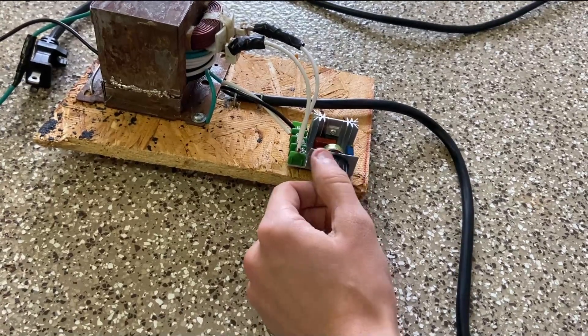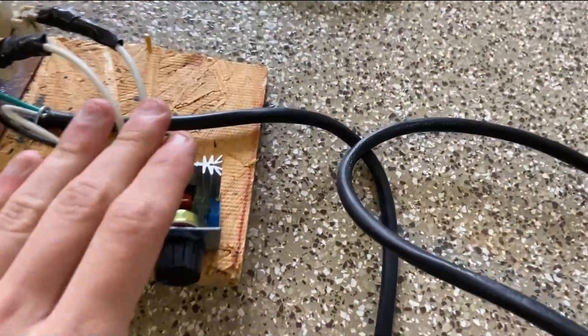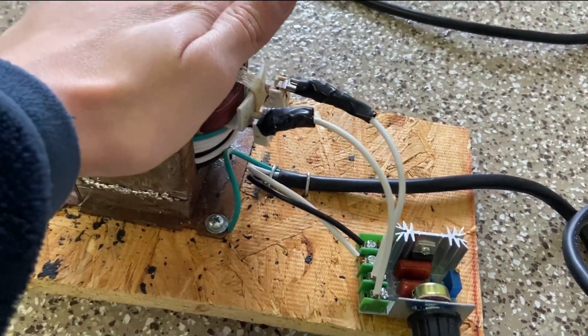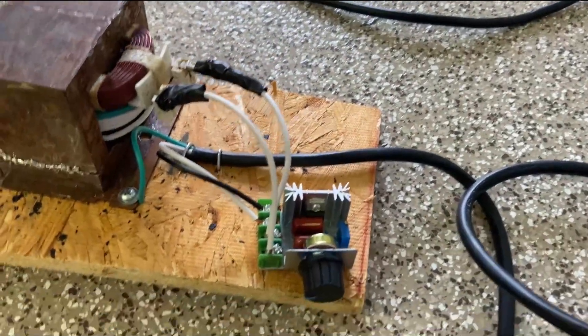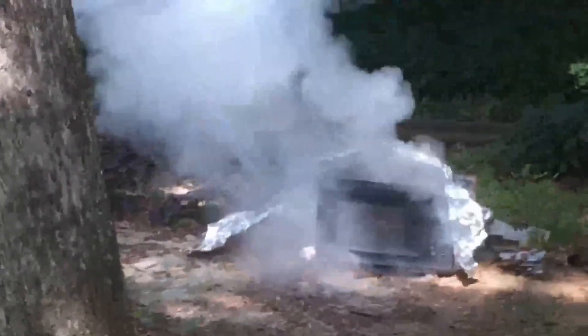Let's shut it off and see what it is. We will unplug it and then hopefully it hasn't overheated too much. The transformer's not too bad. Pretty warm on the controller — we're going to need some cooling for that. But I'd say that's a success; the machine worked, somehow. I was actually quite amazed at that; I was expecting it to explode in my face, as some of my other projects have done, sometimes not on purpose. There are a few modifications that might be necessary: a smaller diameter of cutting wire will allow for higher heat concentration, as well as a straighter wire for more fine cuts. Also, some kind of cooling system just to keep the thing from overheating. I was not burned — I just almost was. Probably better to get a little bit of cooling in there so the electronics don't fry themselves.